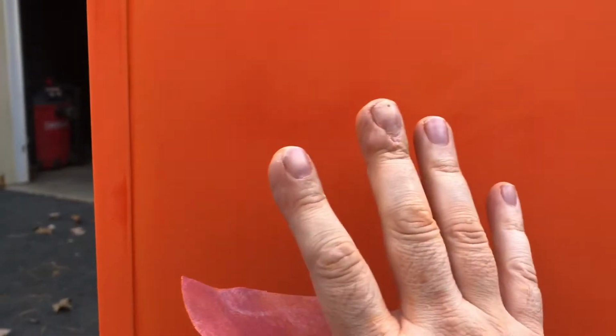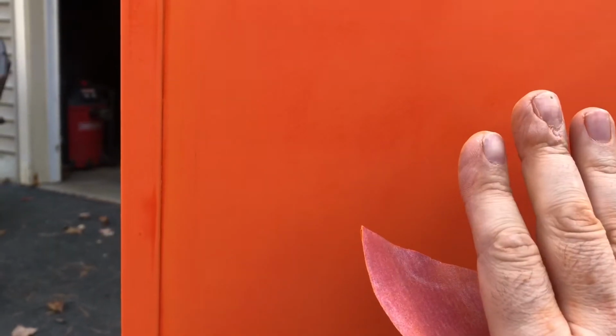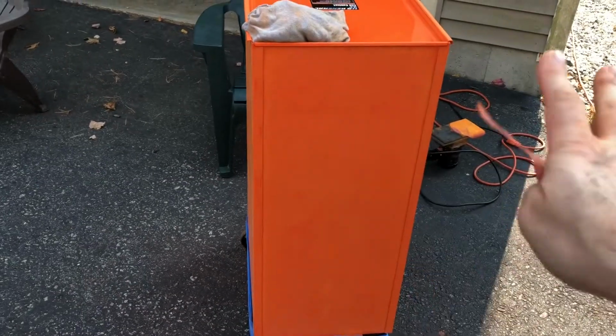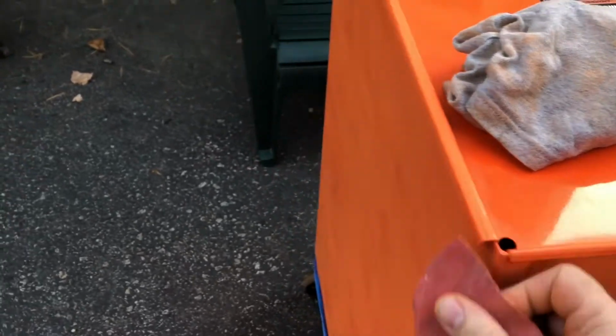But if you watch my channel, then you know one of the things I say frequently: paint doesn't stick to shiny. And basically, sorry for the wind. What we're doing here is, if you tried to paint this powder coated surface, you're putting a flat coat of paint onto a perfectly flat surface. Eventually, it's going to peel off. What we're doing by sanding it is we're creating tons of microscopic grooves in the paint, and you guys understand this. And then the paint that we're putting on top of it will flow into those grooves, and you can double or triple the surface area of this plane by sanding it. You can't really see it to the naked eye, but microscopically it is there, and that will cause the paint to physically stick to your surface.